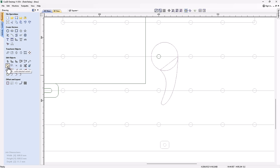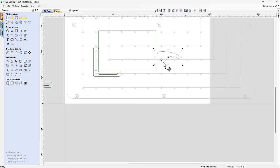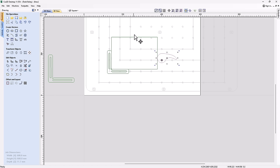So let's just test it again to make sure it's going to work. If we grab a hold of right around here, let's just say this end, and we twist it around, then you'll see that we can actually lock that into place, putting some sideways force on that to hold it against this right angle or our square. And maybe we need to add another one up top to kind of force it down. Now, with this size of material, this version of our square probably isn't the right choice. We're probably going to want to use a longer one if we want to. That way we get a little bit more support on these sides.